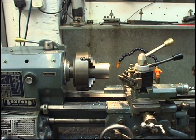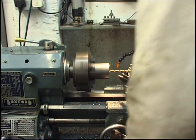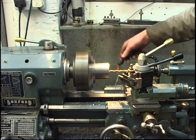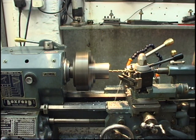On a bigger machine with loads of power, you go straight through with a big drill. Run this 1/4 inch, 6mm drill first. Keep backing your drill out, clearing the chippings, put a little water on. Once you get a hole through, it's not too bad. The chips come out at your end as well.